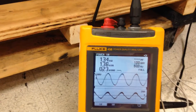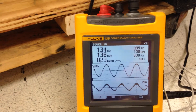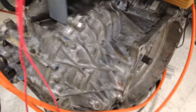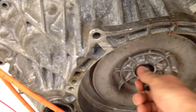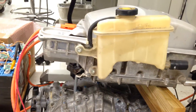So now I'm pumping in 1.34 kilowatts with a 0.99 power factor. It makes kind of a whistling noise at this frequency — I'm switching at 8 kilohertz right now. The shaft doesn't move; it's like a braking action on the shaft because the motor is magnetized during this process.